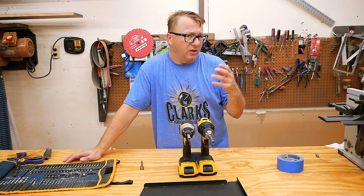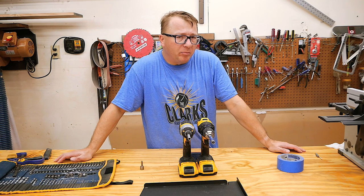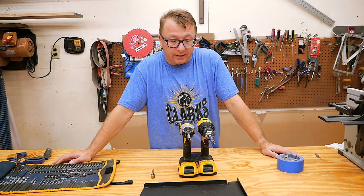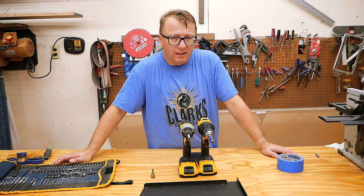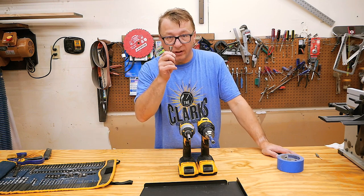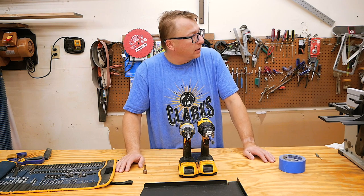For the price of the product, I would have expected the holes for the arms to be tapped. The self-tapping screws were fine, and using the ratchet worked out just fine. I can't imagine how hard it would be to do with a screwdriver, given that it's a flat blade — not a hex bit or a Phillips. I have to believe it would be nearly impossible to get those screws threaded straight into that powder-coated hole with just a regular screwdriver. Definitely recommend using the nut driver here, and use the impact driver to put the lag nuts in — that worked out very well. Then use the screwdriver to pop in the screws for the arms, and everything worked out.